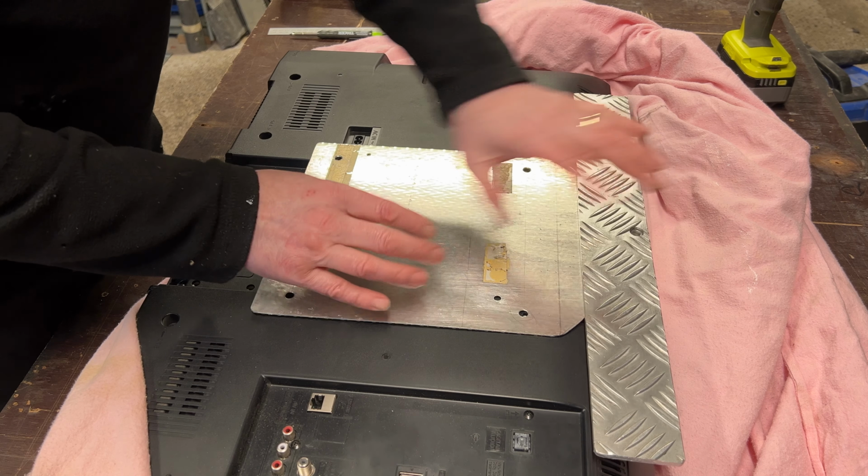I'm going to try to get clever. I want to cut this 45 degrees very accurately, but I also want to cut another slot in each of the two pieces where they join here and put a biscuit joint in, a full length biscuit joint. So that's going to be new to me, so we'll see how we get on with that. But yeah, I'll just slither a couple of bits off here and do a few mitres.